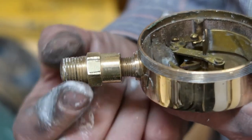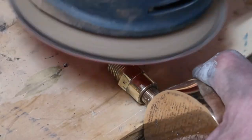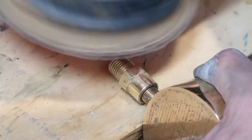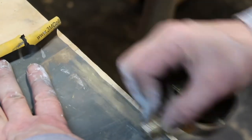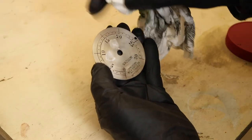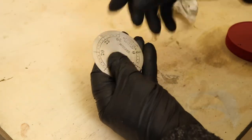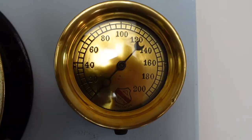I'm going to also remove these tool marks in the brass coupling. Cleaning the face of the gauge with an abrasive has to be done very carefully so as not to remove the nickel plating — though there are some folks who intentionally remove the nickel plating to go down to brass and produce a polished brass face.